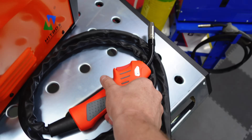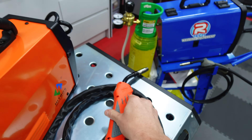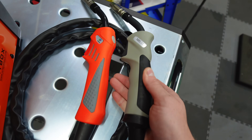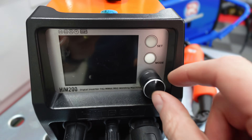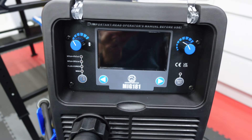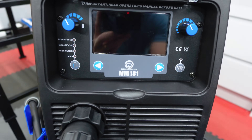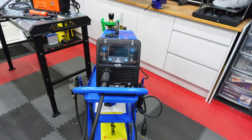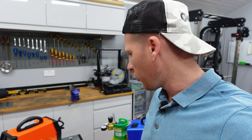The torch with the Team U one feels fairly light, quite plasticky but nice in the hand. The Artec one feels fairly similar visually other than the colour — there doesn't seem to be a great deal of difference between the two. Both welders have a nice little digital display with a knob on the Team U one, and on the Artec one there's a flip-up protective cover with a digital display and a couple of knobs — one for voltage, one for wire speed — plus some buttons. And as mentioned, this one has presets to help you program everything nicely for minimum effort when welding.